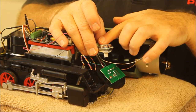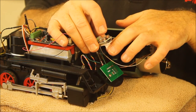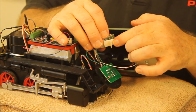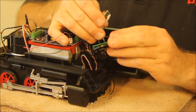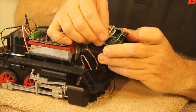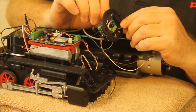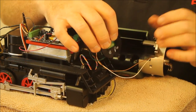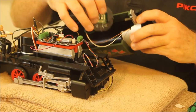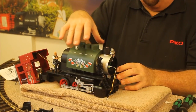Your little voltage regulator circuit board has a clear plastic wrap on it — that's not a wrapper to remove, it needs to stay on there. We're going to put a little piece of double stick tape from the kit on the back of that and apply it to the back of the little circuit board on the black plastic holder, so it's conveniently located and everything is neatly secured. Then this is going to go inside the front of the boiler in the loco.